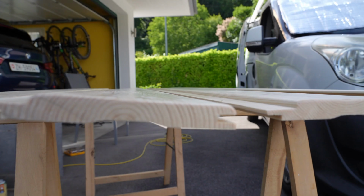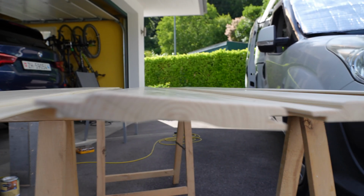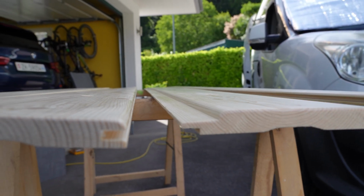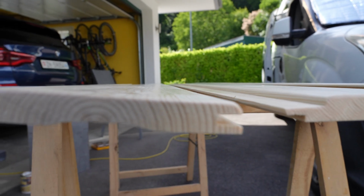One nice thing about this warm weather is paint dries super fast. I already got 2 coats on, and let me show you, because the finish is spectacular. So I sanded it with 180 grit and used the paintbrush, but it shows no strokes at all, and it's just this kind of mirrored finish. I'm not sure if you can see it.